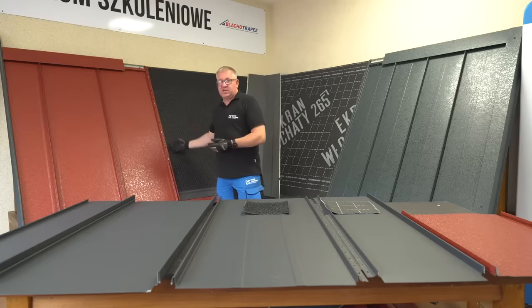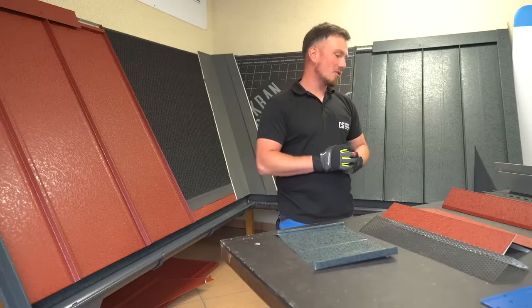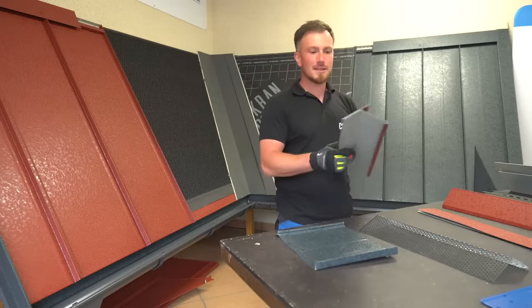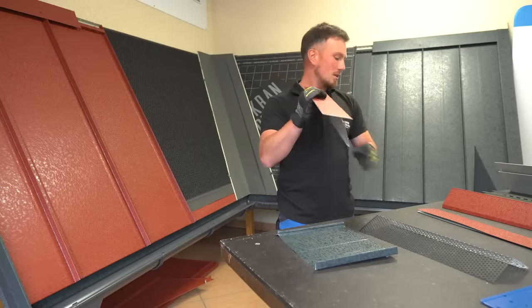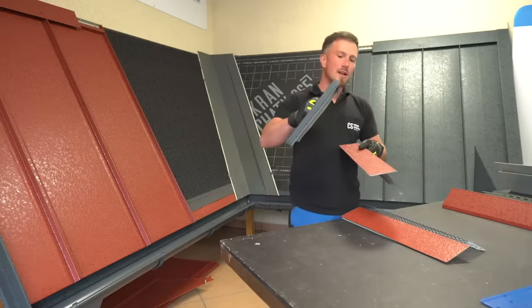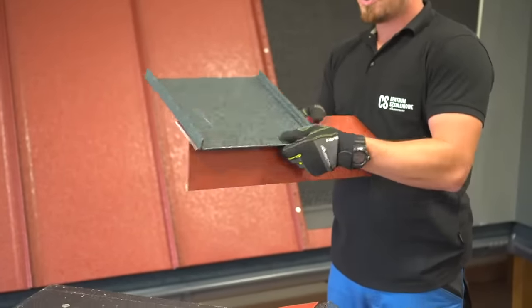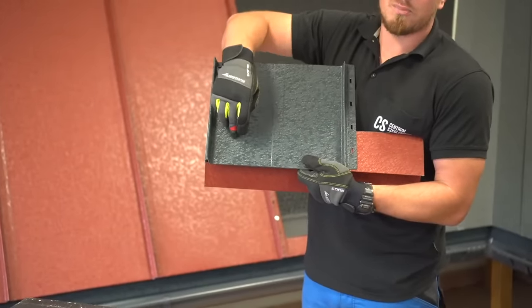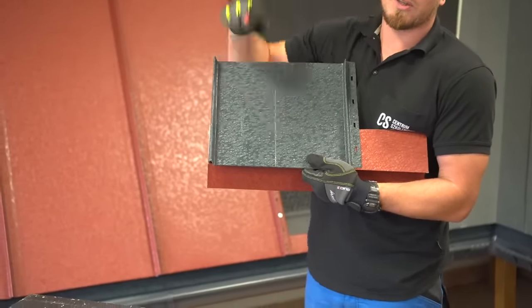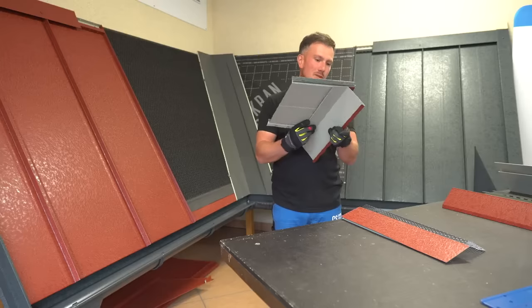It's always best to liaise with your architect for the best solution for your project. When installing our standing seam panels — whether that's the Retro 25, Retro 38, or Hi-Tech — a few options are available using some of our standard flashing. Before putting down the panels, first an eaves drip edge needs to be installed. The eaves drip edge will provide a lip for the bottom hem of the panels to hook into, giving the panels a strong grip without screws, and it can also provide a fascia to the front. After the eaves drip edge is installed on the bottom, the panels can simply click into the provided lip to prevent them from being lifted. No screws ever need to penetrate the panels when they are installed correctly.